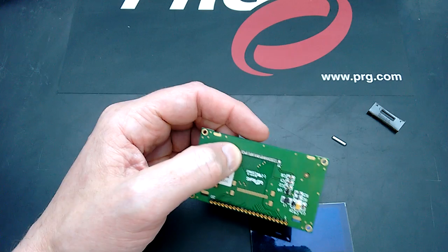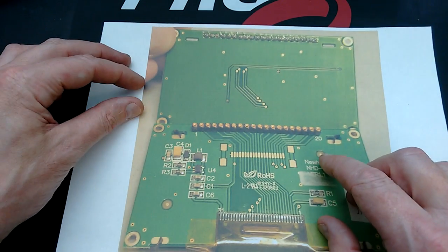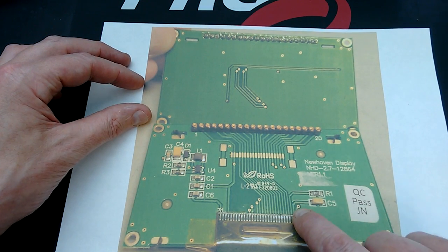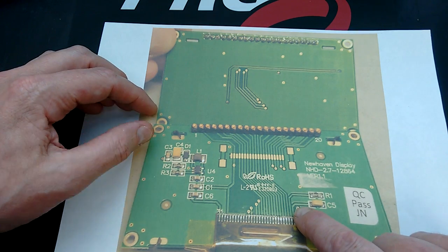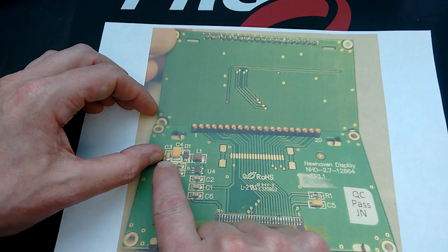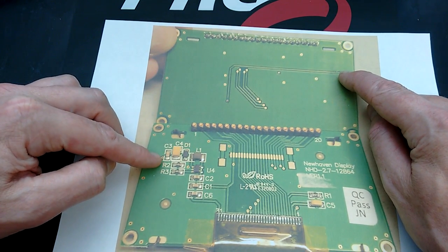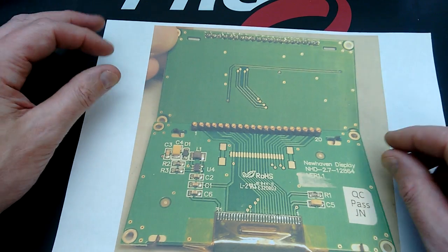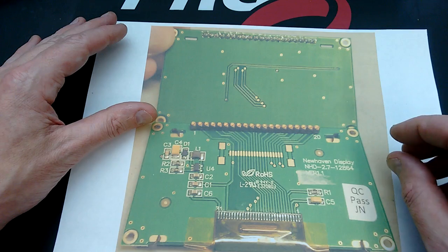I'm not sure what voltage that is — I haven't actually checked that out, it would have been interesting to do so. So to check that out, I got the faulty display and soldered a small wire, which equates to this pad here, onto this track, then ran it over to this end of the capacitor, which equates to that plated through-hole appearing next to the capacitor, and basically just joining onto the end of that capacitor. And that fixed the problem — so that was a water-related corrosion issue with the power supply.